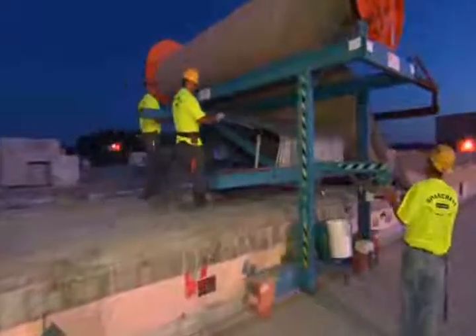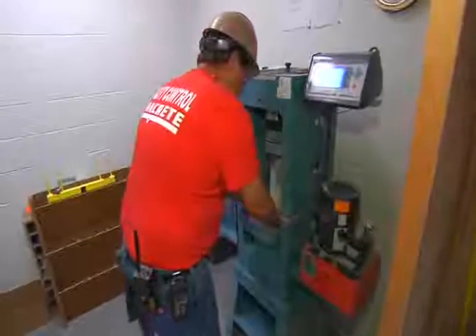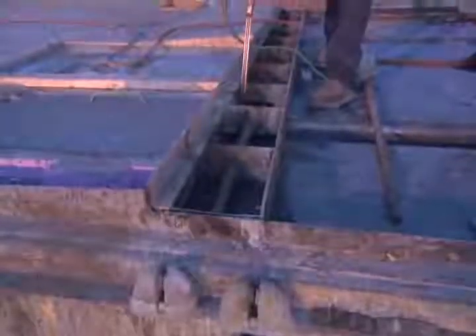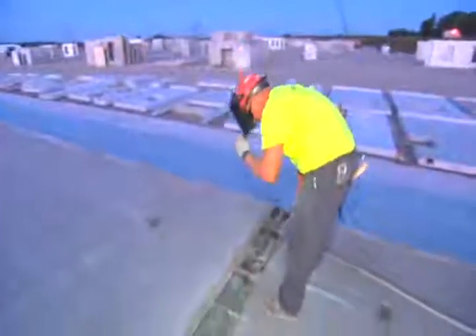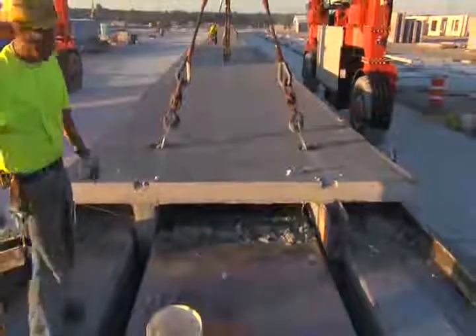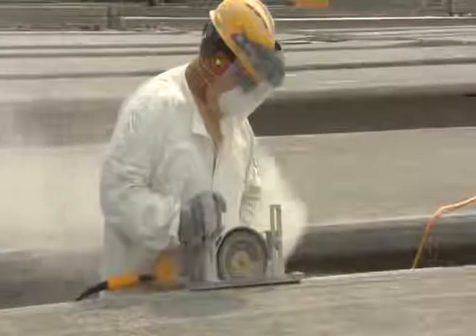After 12 to 16 hours of curing, the T's are ready to be stripped. The QC department first tests the concrete to be sure it has achieved the strength required to detension the strands — typically 3,500 PSI. The strands are detensioned in a specific sequence established by the QC department or the plant engineer. Personnel are positioned at each end of the bed and at some of the intermediate bulkhead locations, and on a signal they burn the strand at each end. After all the strands are cut and block-out formwork has been removed, the T's are stripped from the form and each piece is removed and transported to a detailing area for any minor cosmetic touch-ups.